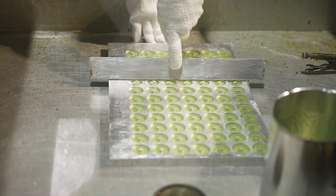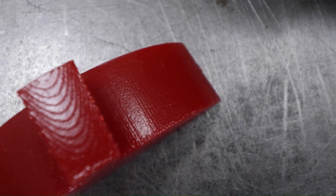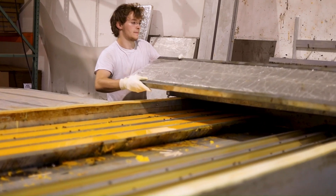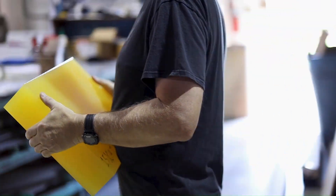Finished parts from a 3D cast mold will have a fine matte finish — similar to what you would see on machined parts. Whereas an aluminum mold is going to produce a very smooth surface finish, machined in some places because that's unavoidable, but smooth for the most part.